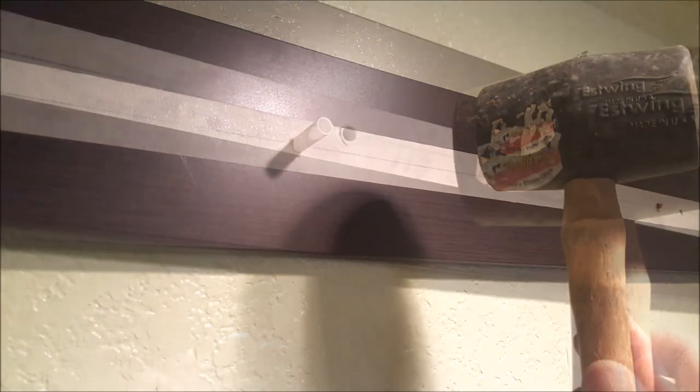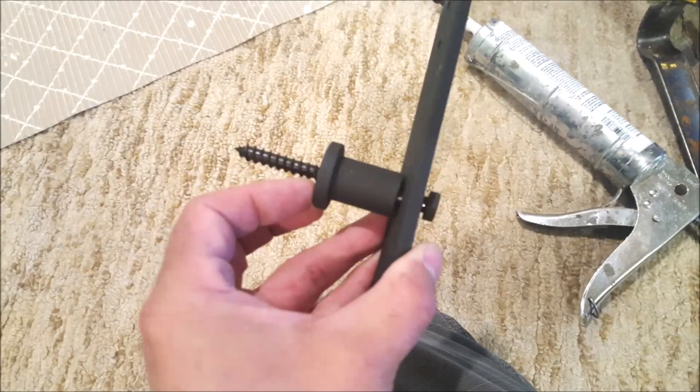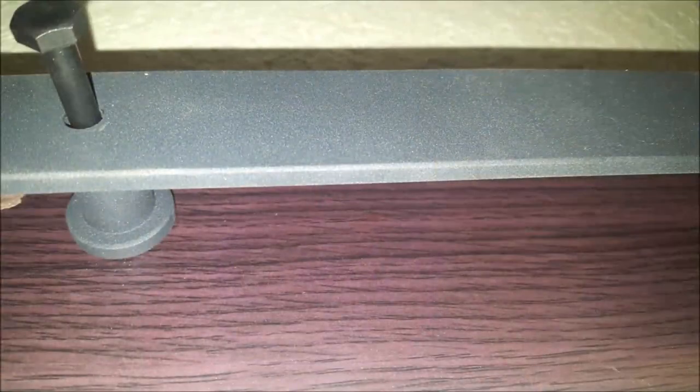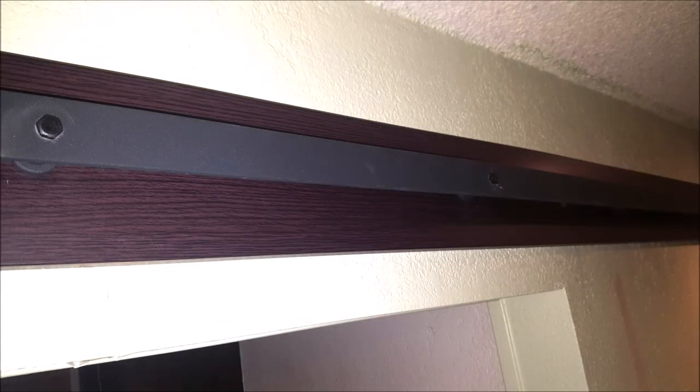Then it's time to place those anchors in the holes you just drilled. To drive those anchors, I like to use a rubber mallet so you don't damage the wood, but you can use a regular hammer — you just got to be gentle. Now line up your lag bolts and spacers; we're going to be using one spacer and one lag bolt for each hole. Before bolting everything into the wall, it should look like this: bolt exposed first, then the track, then the spacer, then the header board behind it. These anchors secure the 3-inch lag bolt to the header and the sheetrock behind it, doing both jobs at once. They are fairly strong and won't pull through the header board, but they could possibly pull through the sheetrock — that's why I secured that header board earlier with 3-inch screws to give it a better bond.